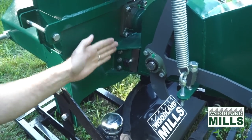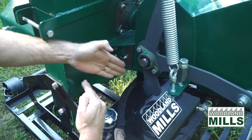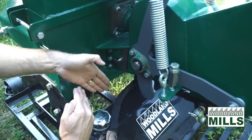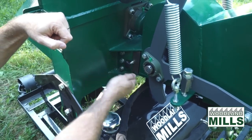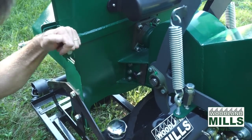So the blades on the flywheel are coming around. This is a fixed blade, and they cut like a pair of scissors, right like that. So we're setting the second blade's edge with the anvil. And again, it moves in and out to set it to the specified clearance off the blade edges on the flywheel.